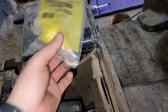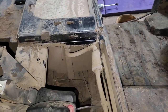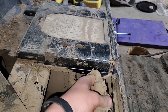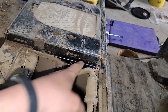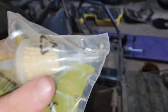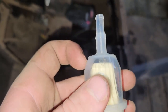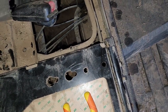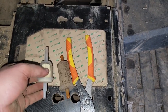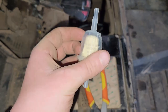Alright, so here's the fuel filter on the gator. This is the new one — it's a little bit different. We're gonna change it. The gas tank's right there and it goes through the fuel filter. To me this looks backwards but I could be wrong. Sometimes they tell you in the packaging how it should go. Alright, I got the fuel filter out of the bag now. There's an arrow on it — that arrow tells me this end goes there and the fuel runs that way through the filter. Here's the old one. It's a little bit different but I've been noticing on all our gas engines they've been changing up the fuel filters to these now.